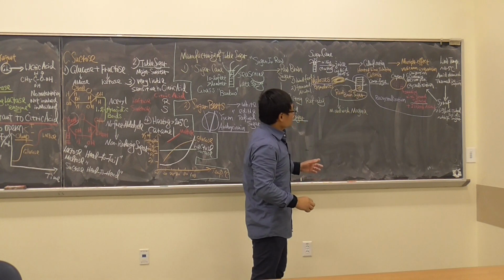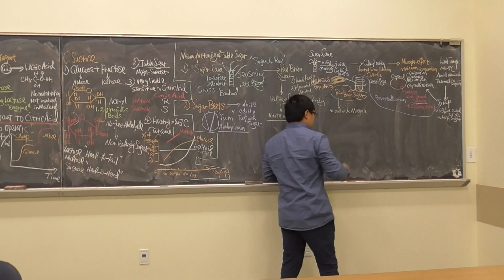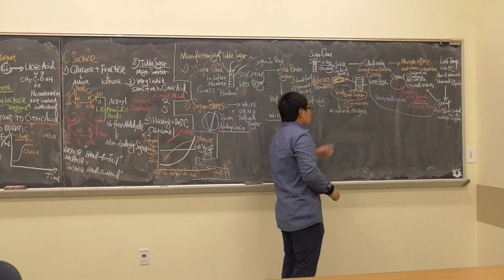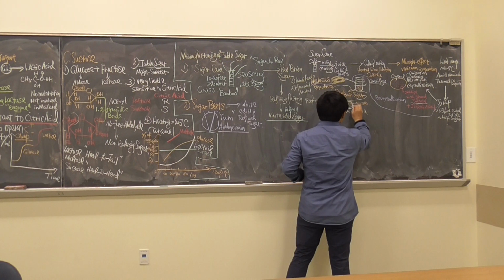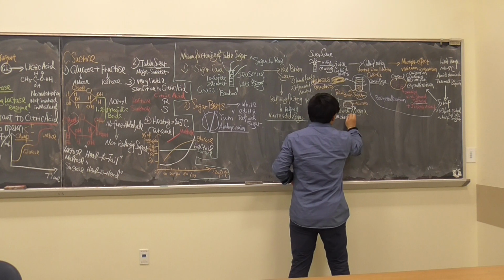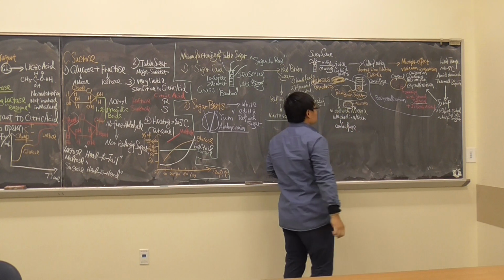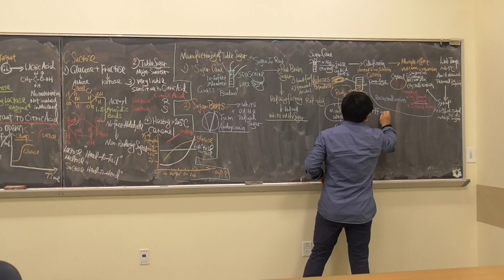So this is how it works. I have a sugar right here. It's a raw brown sugar, and I know I have molasses on the top. I want to remove it. How do we do that? We add another layer of syrup, which is magma, and then we wash with water, and then we do centrifuge. This process is called affination.